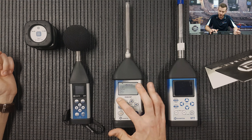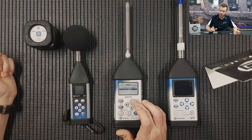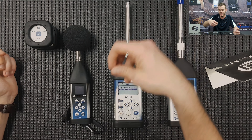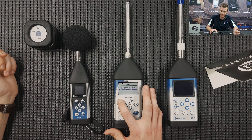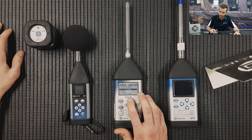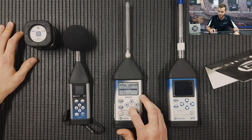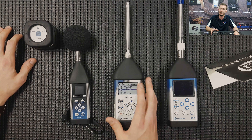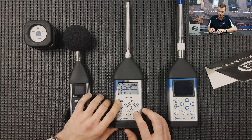So Shift + Menu. We have our function, we have our mode. You can use this as a vibration meter by taking off the TNC adapter SV80 coil cable. We're doing a sound measurement today, so we're going to go down to measurement function. This is where you can select what measurement parameters you want — FFT, RT60, dose meter options. I'm going to do a one-third octave measurement. That's pretty standard for a lot of clients.